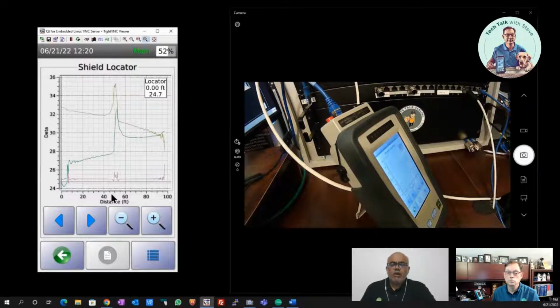But if along the way you increase the data rates, or if you have external noise sources that come into play, then you may start having problems, particularly at the connection points. The cable itself, either FTP or SSTP, is very well protected against noise. But at the connection points, if there is a transition from one type to another, you have some weaknesses. So I think it is not a good practice to mix and match different cabling types in a single channel. Ultimately, we have shield because we want the cable to have very high noise immunity, and by such mix and match, all the effort that we put into ensuring this immunity gets compromised. So why do that?